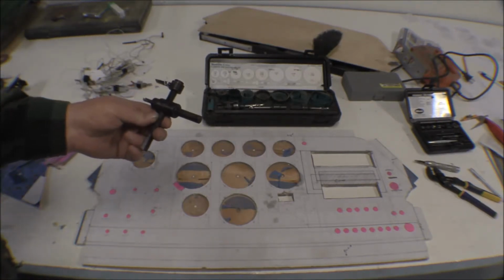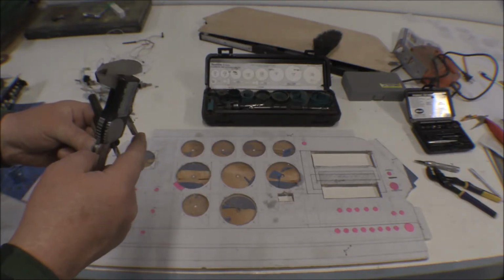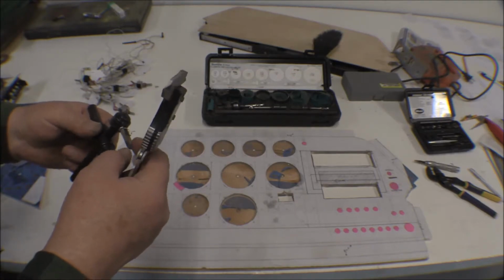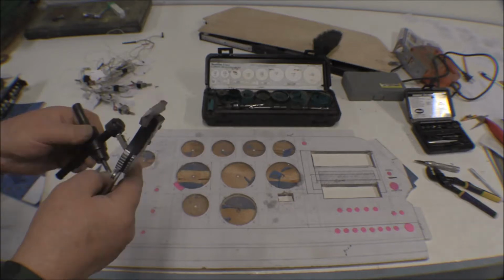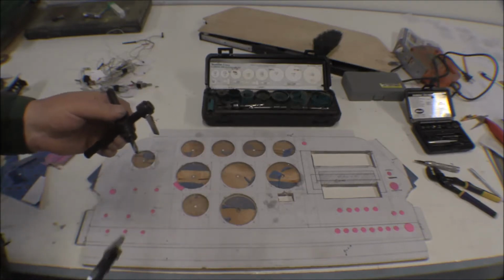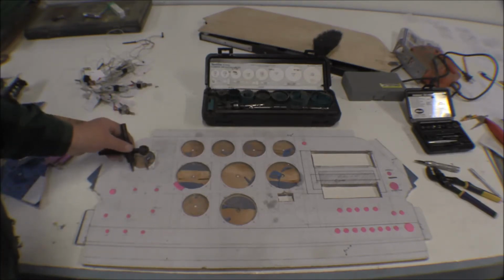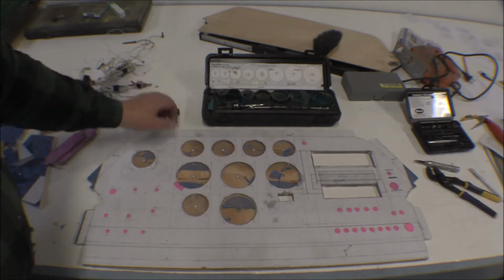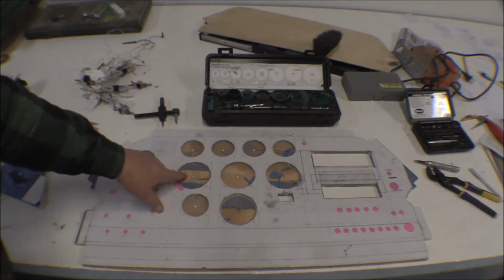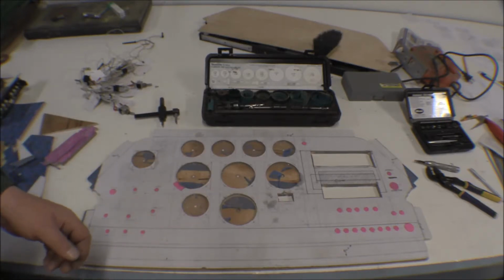What I did use, I had this circle cutter, and I went ahead and sharpened it up a little different than for the wood cutter. I gave it a little bit more clearance angle on the back here, and just knocked off the sharp point a little bit, rounded it over a little bit, sharpened it up, and then I set it up according to these instructions on here and cut those holes out. And it cut really nice. So those holes were cut out, and having that 1/4 inch plywood backer worked out real well.